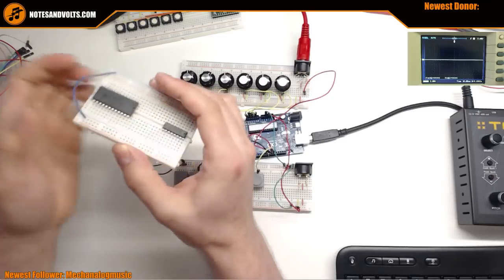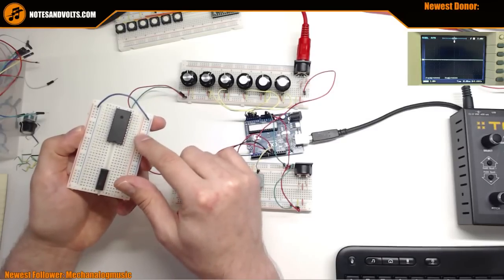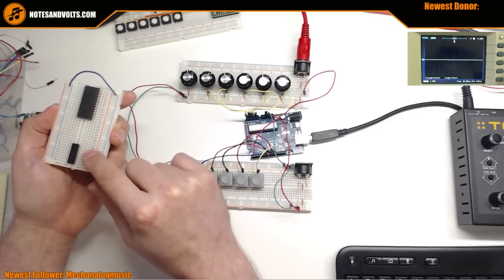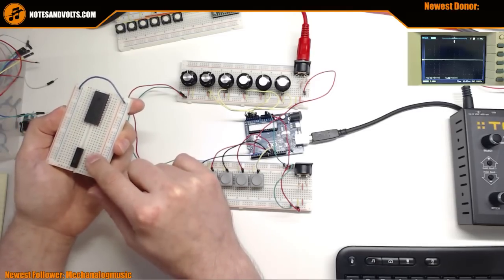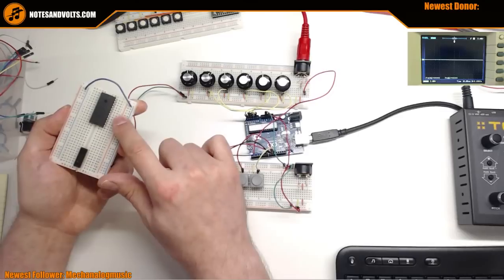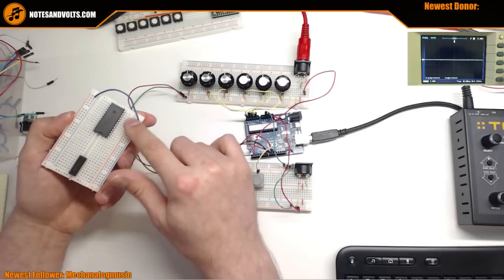The way to add more controls to your Arduino is by adding multiplexers - a very simple device in theory. We're using two types. The small one is an 8-channel multiplexer, the 74HC4051 - a one-output, eight-input multiplexer. If you don't need a lot of controls, this is a good one. The bigger one is a 16-channel multiplexer, the 74HC4067, giving you 16 possible controls.